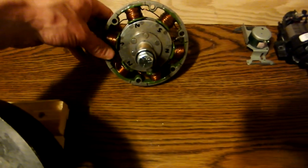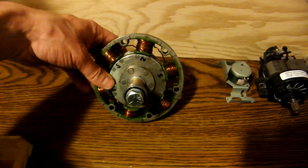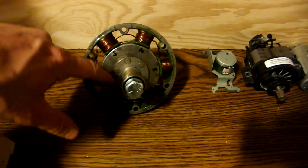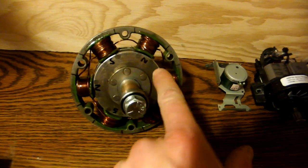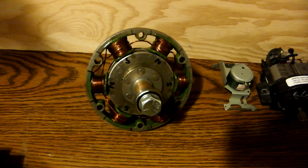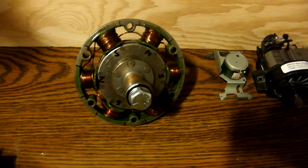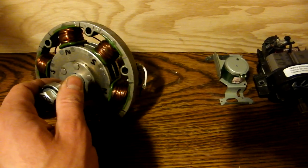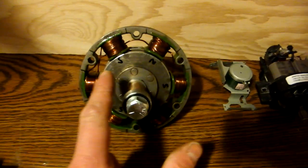Here's another idea: if you've got a motorcycle laying around, here's a motorcycle alternator — otherwise known as a stator. The outside is actually the stator with your stator coils, and this is a flywheel with magnets. The arrangement is actually that of a Bedini or Adams motor because the poles are alternating. I've actually run this stator without rewinding it — just hooked up a normal Bedini circuit and it will run as a motor. The only problem is the wires are very thick and you'll need to rewind with much smaller wire that consumes less power.